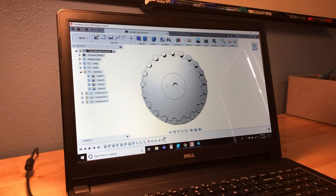This wobbling motion rolls the internal gear around the inside, and forces it to engage with all of the external teeth. The reason this reduces the speed is because the internal gear has one less tooth than the external. So each time the input shaft makes one full rotation and pushes the gear all the way around, the internal gear will shift over by one tooth, since there is one tooth difference between the internal and external gears.